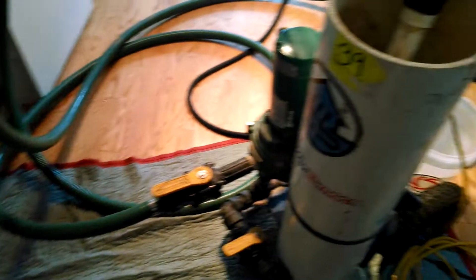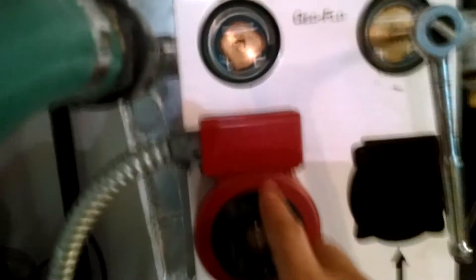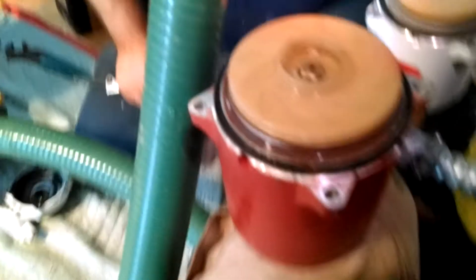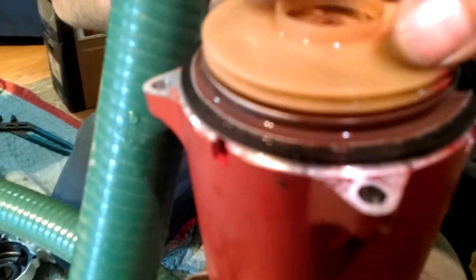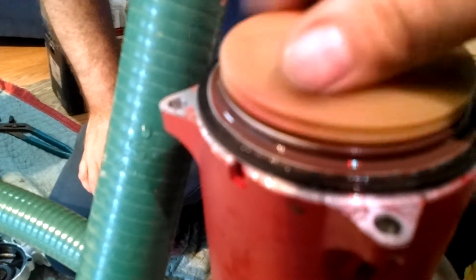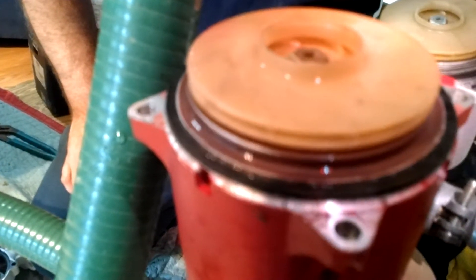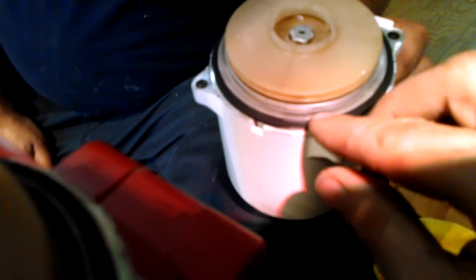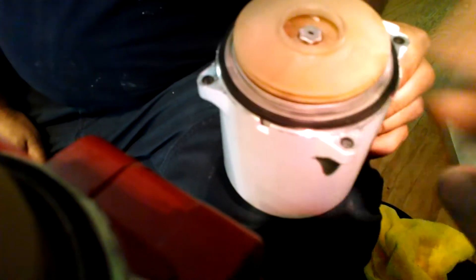So what I've done is I've just opened the system to my flush cart. I got the T's. So now I'm going to pull off the motor. Here's the old pump — it was actually seized up when I first tried to move it. So we're just going to go ahead and replace it. The new pump comes with the new gasket, so we're just going to go ahead and replace it.